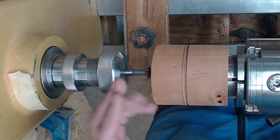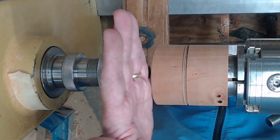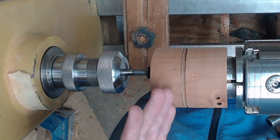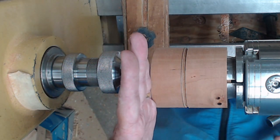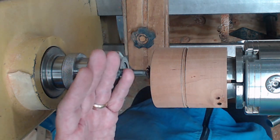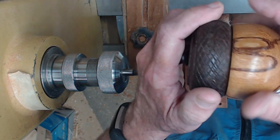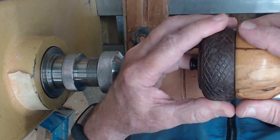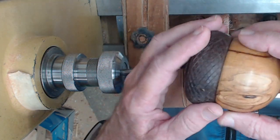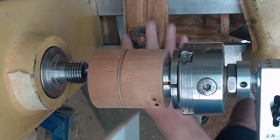I lost the sound on some of these clips so bear with me on this voiceover, but you can see here that if you don't have that cutter parallel — if your project is tilted a little bit to the left or to the right — you're going to have uneven threads, maybe thicker on one side. Worst of all, the two pieces may not square up. But lining this up correctly will ensure it every time.